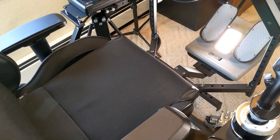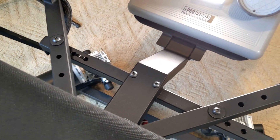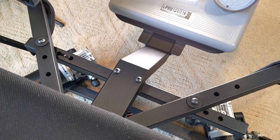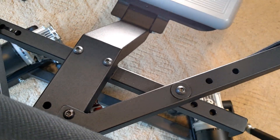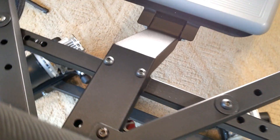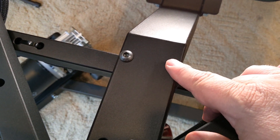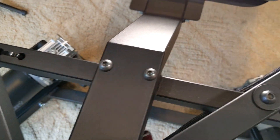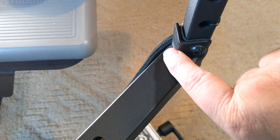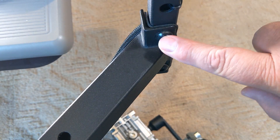There's another key area where I highly recommend fender washers — most DOF units I see online have dents on certain bolts where they've been over-tightened and deformed the metal. We've added one-inch fender washers there to help spread that load. When a bolt is on an edge, the shoulder gives a little more strength and a washer isn't as critical. And when you have a frame with a bracket, the bracket itself acts as a washer when you tighten up, so no extra washer is needed there either.